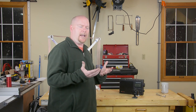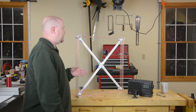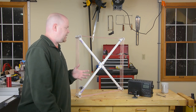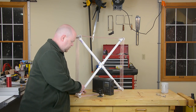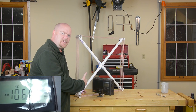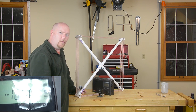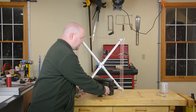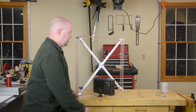Let's go ahead and add the loop to the mix and see what happens. The first step is to point the loop in approximately the direction of the station — the basic idea is that you have the plane of the antenna pointing toward the station. Then we couple the radio with the loop — the easiest way to do that is just set it in the middle. My last important step is to adjust this variable capacitor to actually tune the loop to the station. Right now I have maximum capacitance, which means the lowest end of the band, but as I start to reduce the capacitance, at some point we will start to see a notable spike in the signal. Right about there seems to be it — we've got almost full signal on this station right now. And sure enough, if I turn up the volume — definitely listenable.